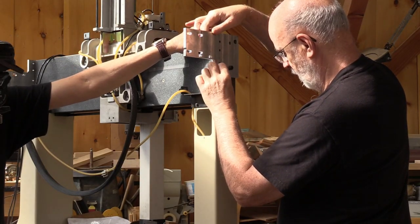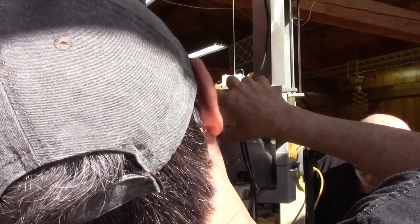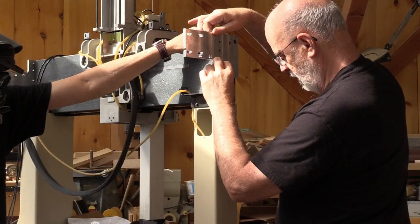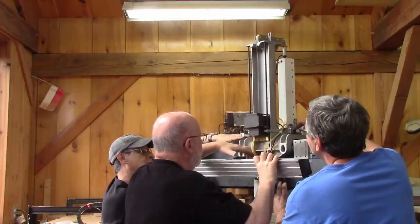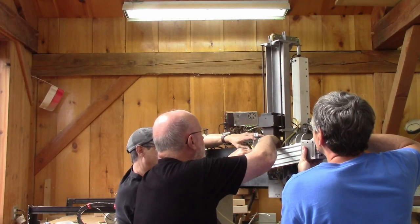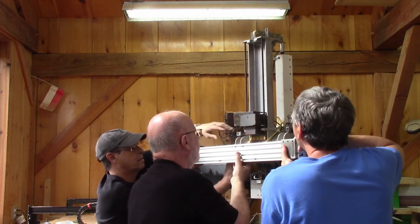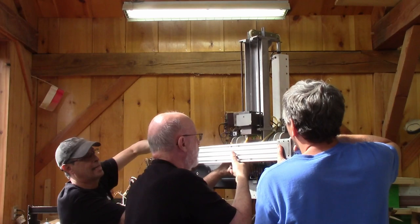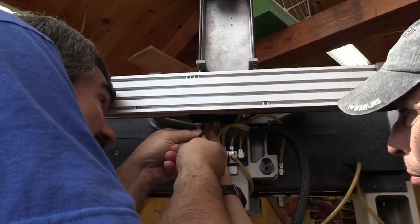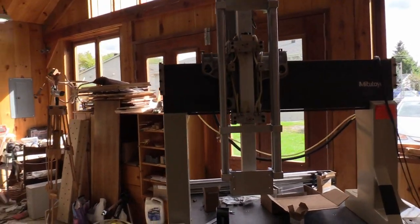This is the day where Philip and I head to Alain's shop. First we mount the hardware for fixing the X-axis, using threaded inserts installed by the manufacturers for previous attachments. Here, installing the side brackets and making sure they're straight, installing some of the welded steel angles that would hold the ball screw and stepper motors, and finally connecting the X-axis to the boom traveling carriage.